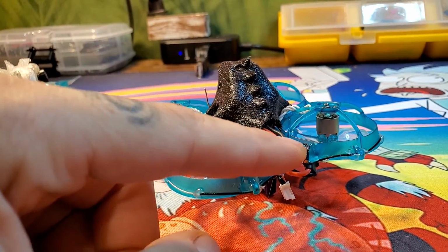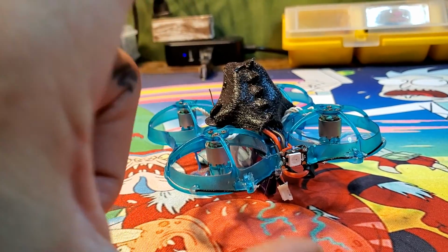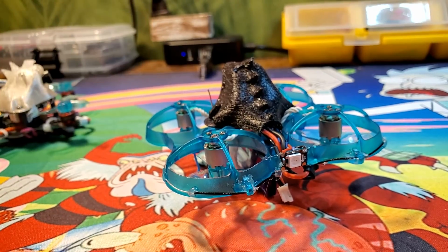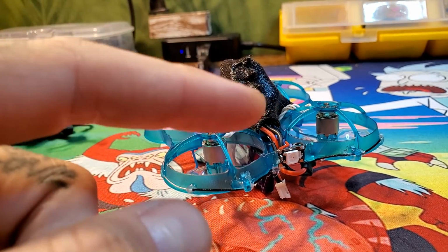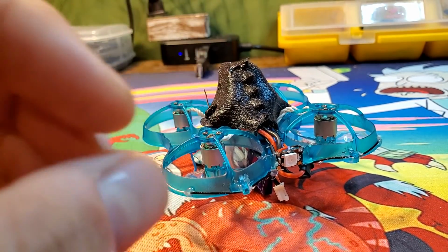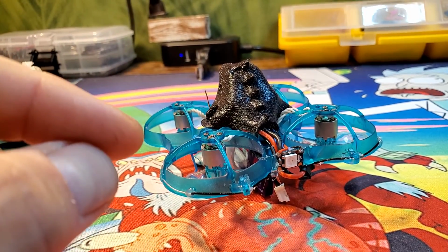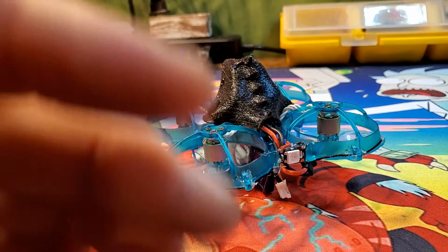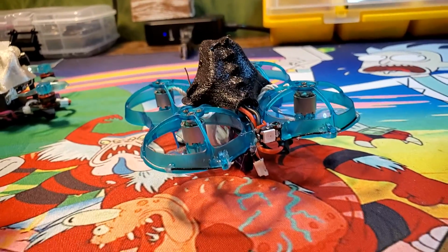And they're programmable. So this comes in a huge strip. There's like 20 LEDs, and you can cut it to any length, 1 or 20 or 10, and they're programmable. So when it's in idle mode, it pulses blue, the same color as the frame. And then when I go into arming mode, it flashes green. And there's just an endless amount of things you can do with it.